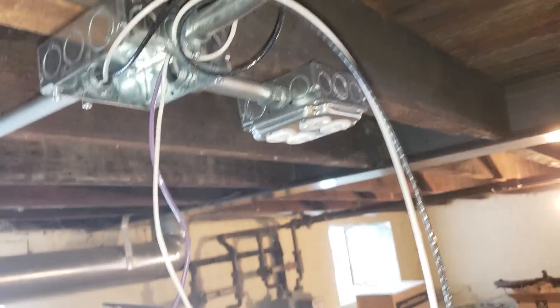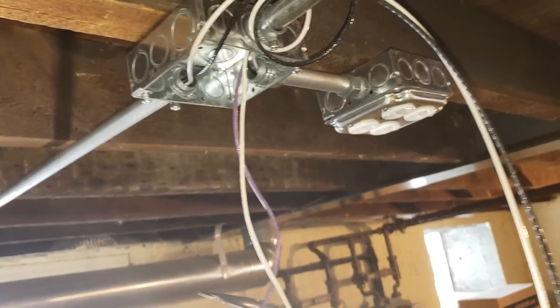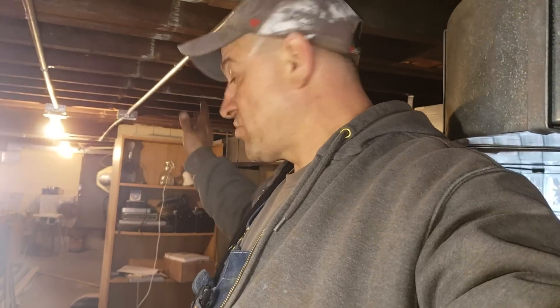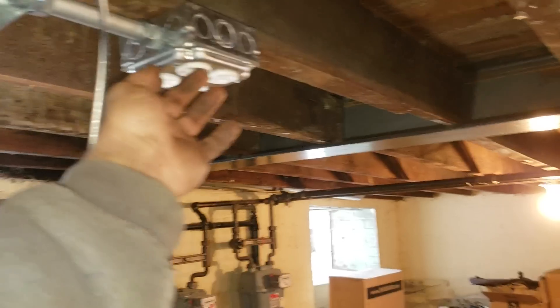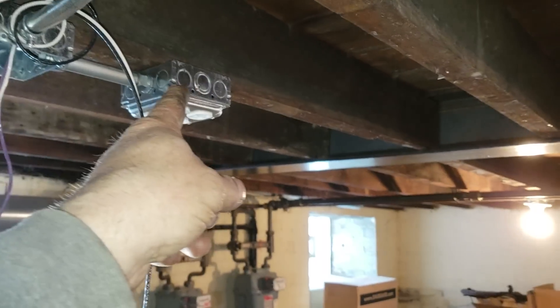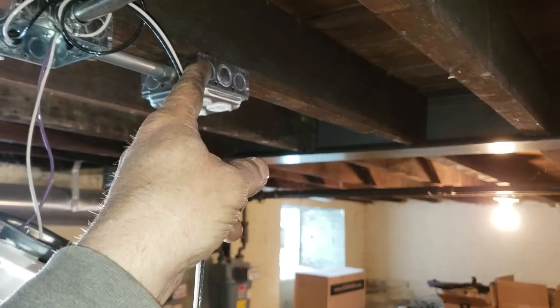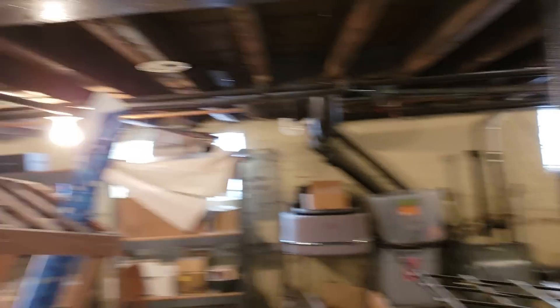This is common. They didn't even have a common panel before. They had no common pipes — so all the common stuff, like the front hallway and rear hallway that are common areas, has to be on the common panel. I also gave this guy some quads down here for when he's working in the basement. I alternated — one outlet here, outlet over there, outlet over here — zigzagged them. So all of this basement stuff is also on the common panel.